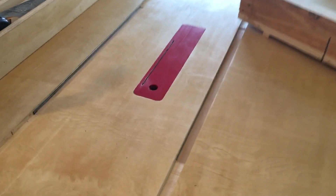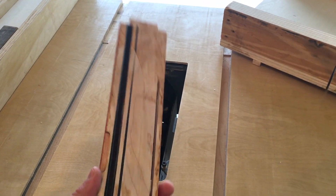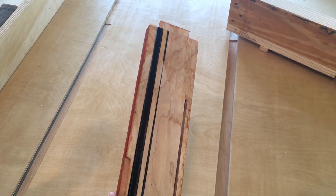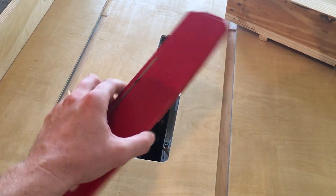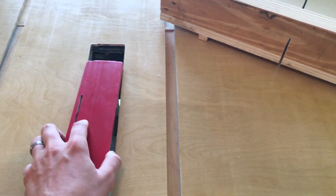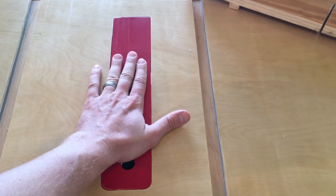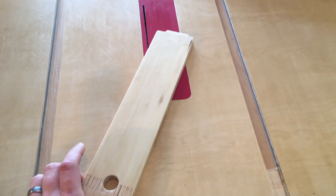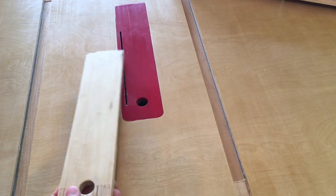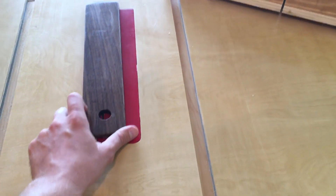For the insert, I did the exact same thing — drilled in and then used a router bit to come through. My insert was basically just an old piece of crown molding for some cabinets that I took and glued up and sanded down. It's a lot thicker than the one that came with the saw. I knew I needed some hardwood because I tried doing it with some pine and it warps a little bit, so that's definitely not the best thing for inserts. I went and got myself some walnut and started making some more.